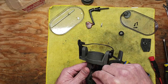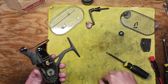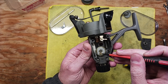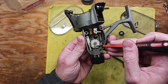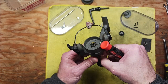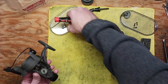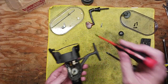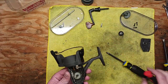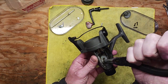Very dry on the inside, I would say, as far as these things go — but that's okay, that's part of the reason why we're doing this. Now make note: there is a brass bushing on this knob right here on the crosswind gear. You want to make sure you do not lose that brass bushing, because it'll create a gap that you don't want with the crosswind block oscillating in there. Just make note of that brass bushing — don't lose that piece.